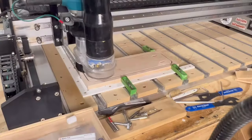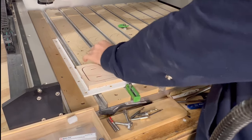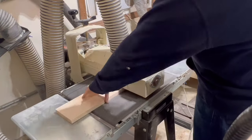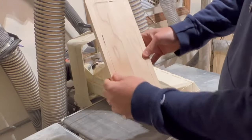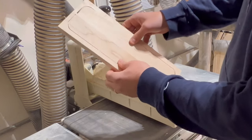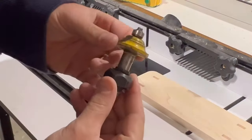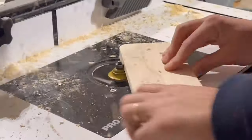Only taking about 7 minutes to complete. Once that was done carving, I realized I made my first mistake on this project. The bit didn't travel all the way through the workpiece because I must have measured my thickness incorrectly. To fix that, I brought it over to the drum sander and removed material bit by bit until my entire component was exposed. Once done, I could clearly see where the tabs were and used my multi-tool to remove the piece from the stock material. After separating it, I headed over to the router table to add a fancy edge to make it look a little more professional.